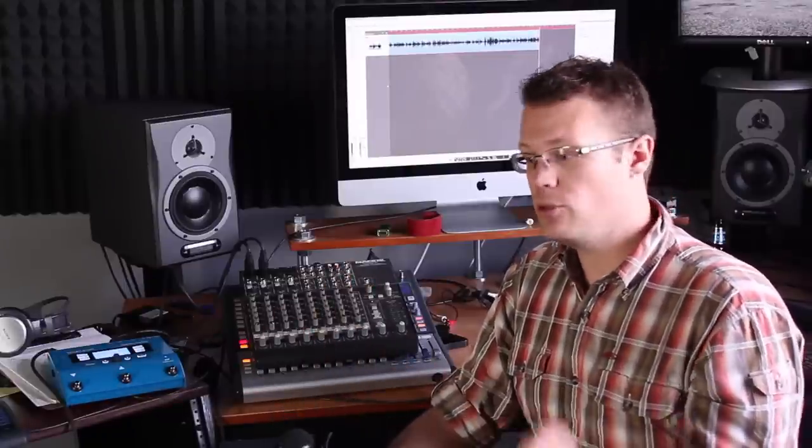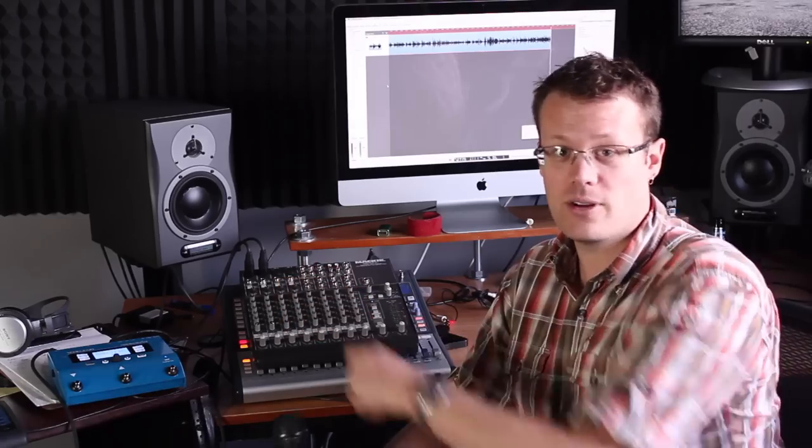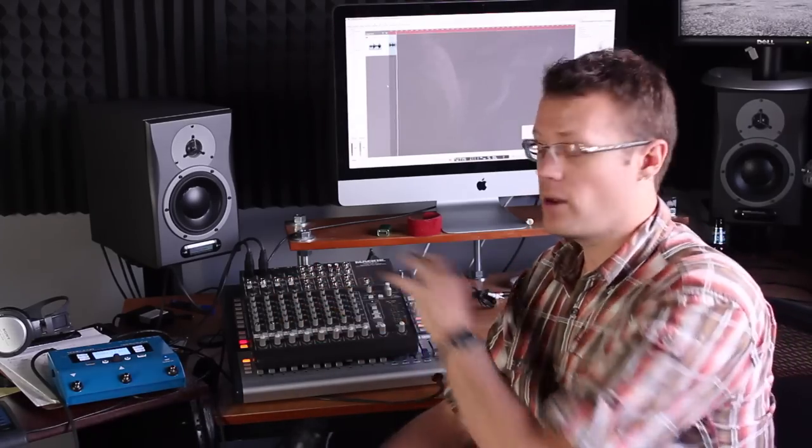They've got a preamp in them. They usually have a master gain. Even if you don't have a channel gain at all, and you just have an input and a master, it doesn't matter. You're still going to want to adjust that input to make sure it's not clipping when you've got a TC-Helicon device in between your mic and the PA.